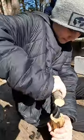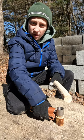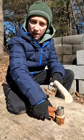I'm starting the hole with the gimlet, then using a settler's wrench to open it up into a one-inch cavity. It goes down about four inches. Then flip your settler's wrench to cut a peg into the cap.